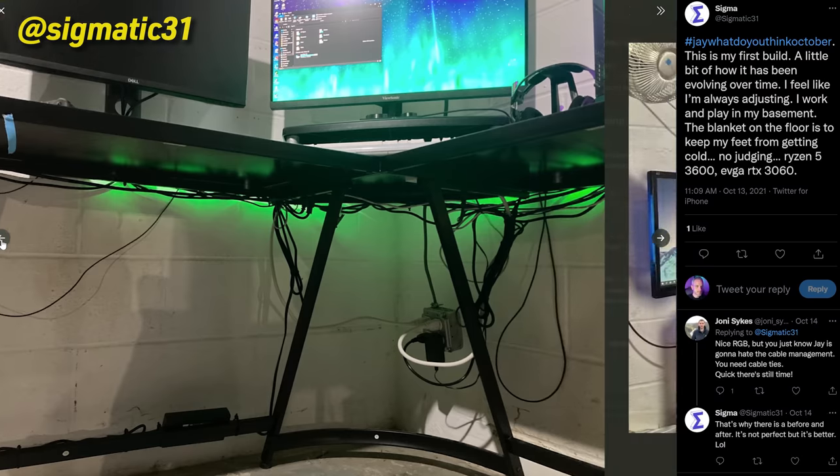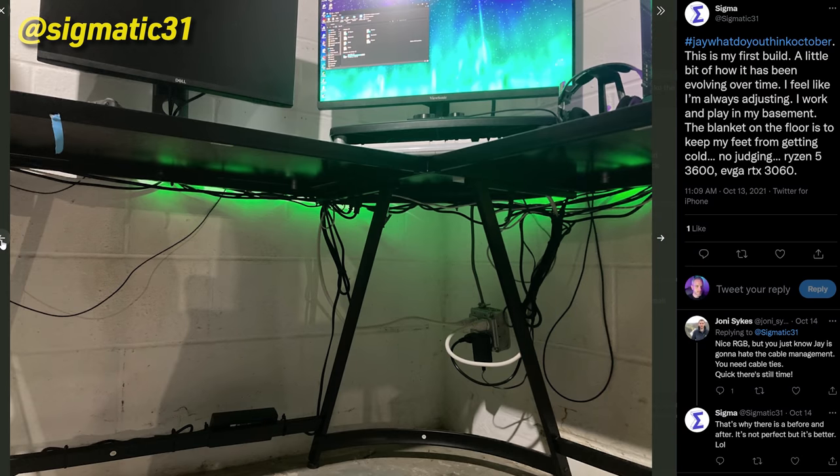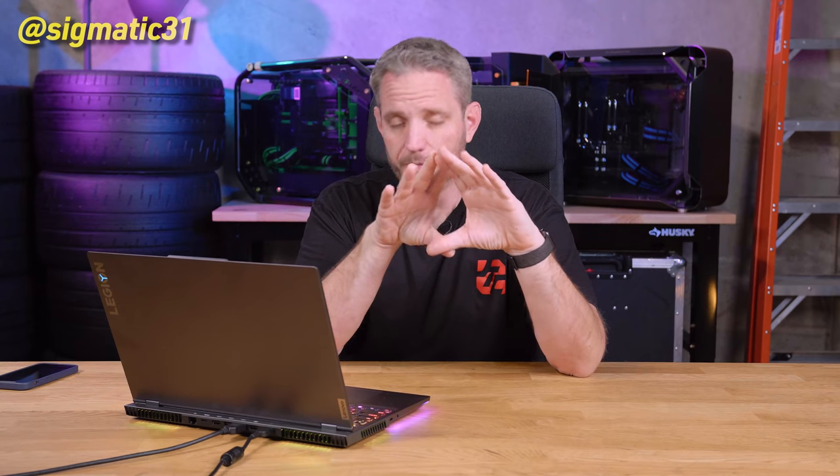Now, go down to Home Depot, get yourself a concrete bit, unplug this, if you know what you're doing with electrical, otherwise hire an electrician, please. Open the box, put it against the wall, draw holes of where the mounting holes are for the backside of that J-box or junction box there for the power cables or for the plugs. Get yourself a $10 concrete bit and a drill and put anchors in the wall and mount it to the wall. Anything like that should not be floating around.